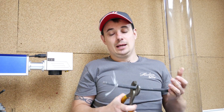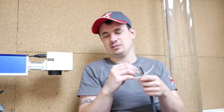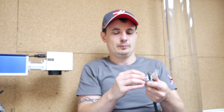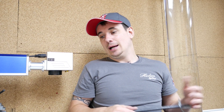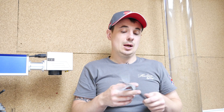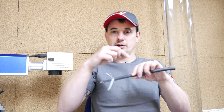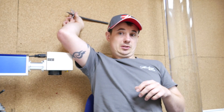If SWA is not terminated correctly, it might as well be any other cable — you can go through it with a shovel and it provides no protection. So make sure it's terminated correctly using a proper gland kit, such as a brass gland kit, or the newer speed-type glands. The key is that the earthed outer sheath is actually connected to the earth inside the enclosure. Con: it's time-consuming to terminate — you've got to strip it all properly, though there are now tools with a small blade that ring around it and make the process much quicker.